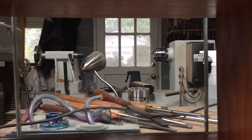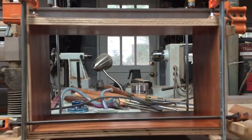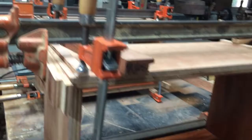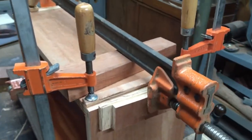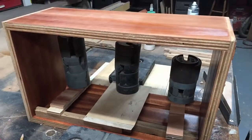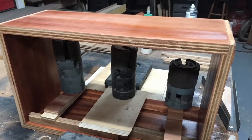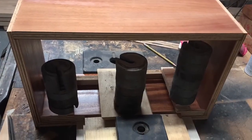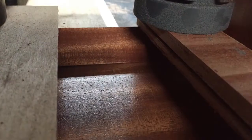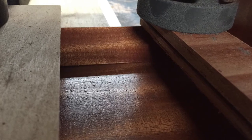The next step after making these eight pieces and gluing them together was to glue in a triangular strip in the back to mask the screw holes that hang the shelf units. At the top of each case I pre-finished all of the interior space on the plywood before putting them together. I used weights from the shop with cantilevered pieces resting on top of the triangular piece, holding it down nice and tight, with two blocks in the front and back to keep the piece from moving on the shop table.